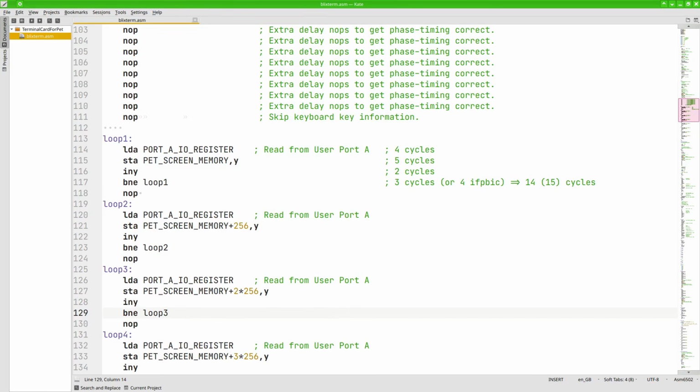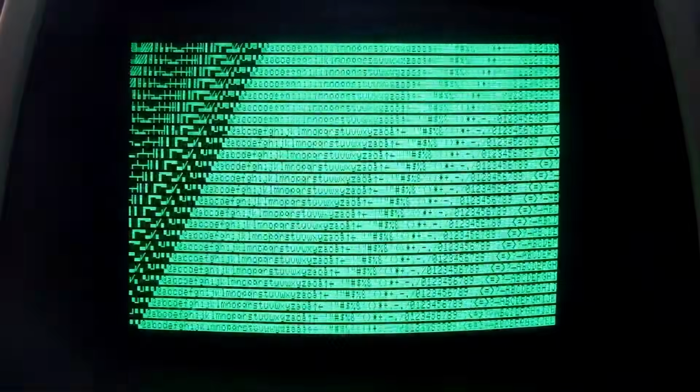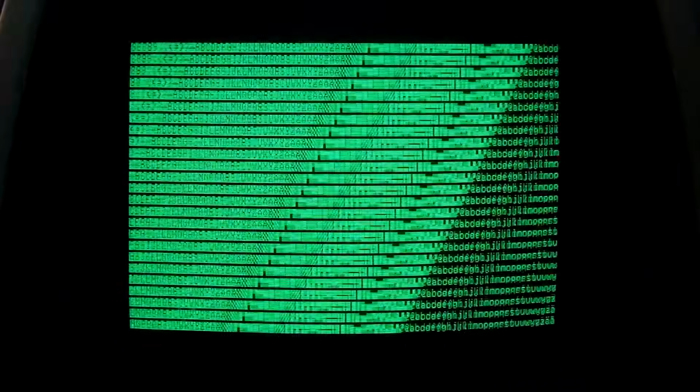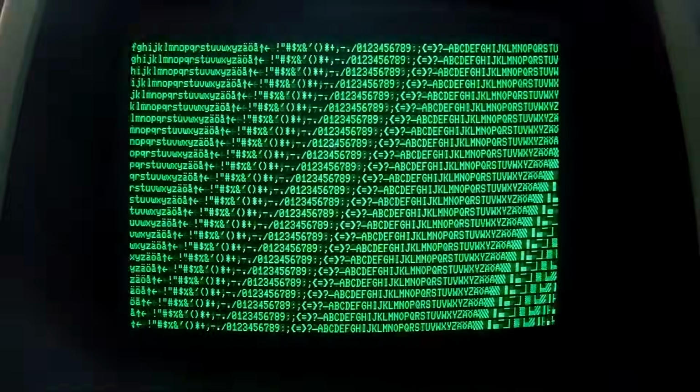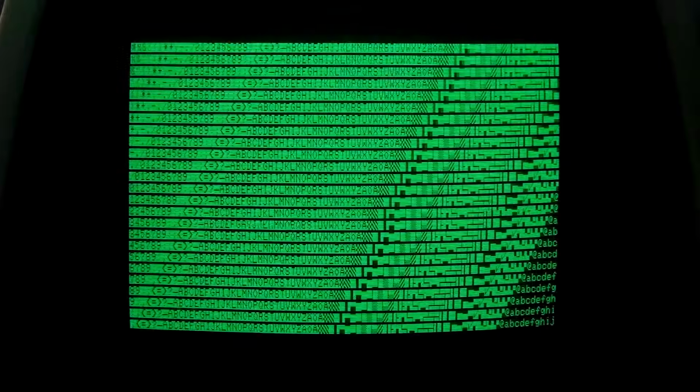This adds 1 extra instruction per 256 iterations of the loop, or 2 cycles for every 3600, so on average I slowed down by 0.056%. Luckily this adjustment was just enough to match the hardware clock. When this and a couple of other issues were fixed, I managed to have a rather smooth scroll. It looks a little bit better in person because the update frequency of the copying, the CRT refresh rate and the camera capture rate interfered to make it look a little bit jerkier than it actually is.